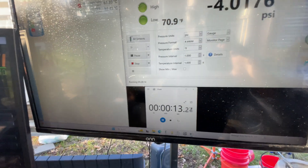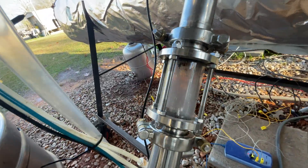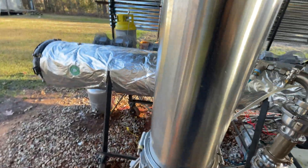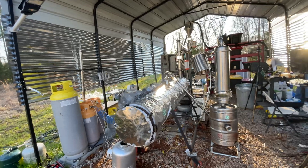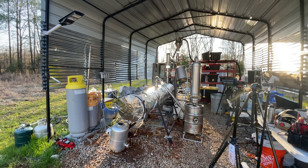I always forget to turn the timer on — we're probably about 10 minutes in. But already we can see the sight glass is starting to fog up a little bit. That means whatever is in the chamber — which is plastic — is breaking down under microwave degradation, releasing water vapor and some of its own vapor. Mainly in the beginning, it's going to be mostly water vapor; that's the first thing that comes off.